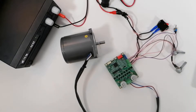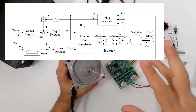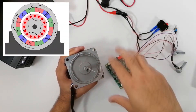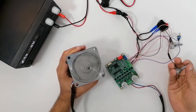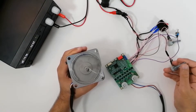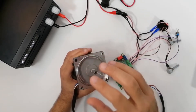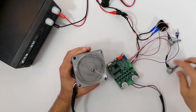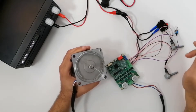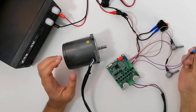To explain a little bit more: to control an AC induction motor, SOLO operates in field oriented control. One of the methods of controlling the speed of an induction motor is generating a rotating field on the stator. The intensity of that field is controlled by this potentiometer, which is in charge of the magnetizing current. When this potentiometer is at zero I'll have zero amps; at maximum I'll have 10 amps contributing to the magnetizing current. The other potentiometer controls speed from zero to maximum — 6000 RPM in analog mode — and the switch changes the direction of rotation.